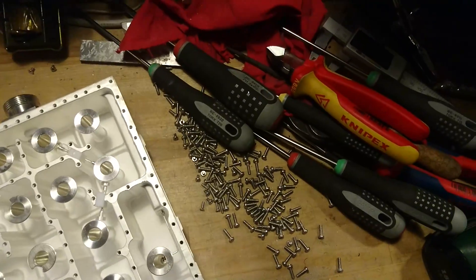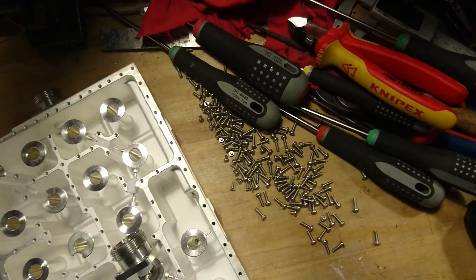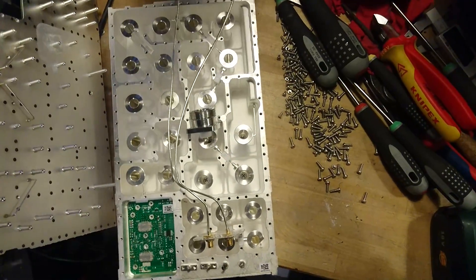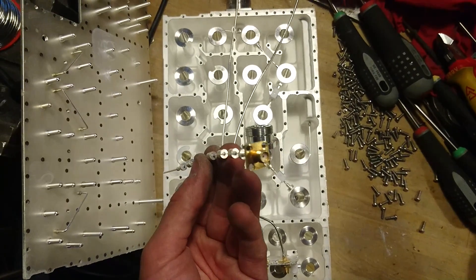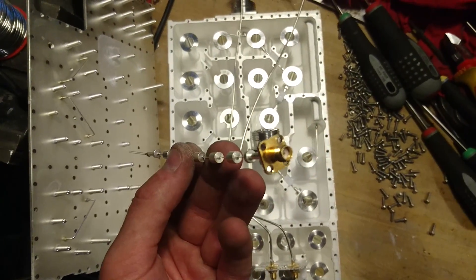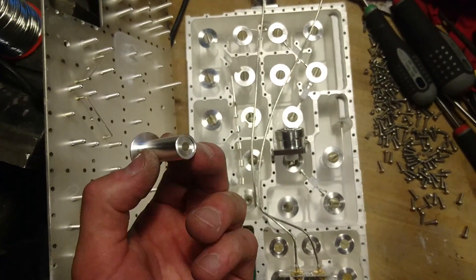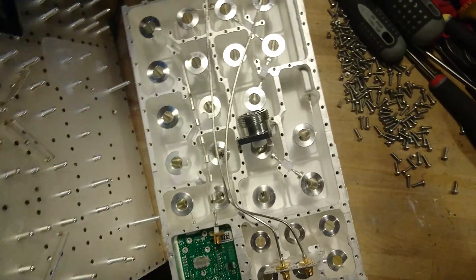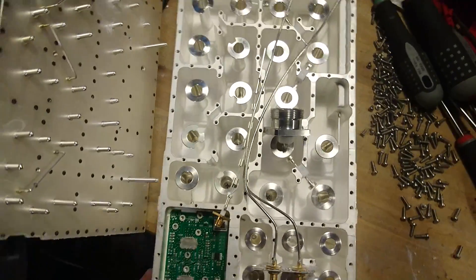There's a whole variety of parts that come out of this: there's of course the antenna connector, some of the thinner cables, some of these feedthroughs — must be something to do with attenuation and such. There are also the cavities themselves — nicely made pieces made out of brass and silvered — and the box itself is an aluminium box covered in silver.